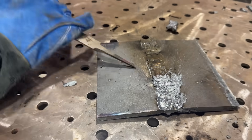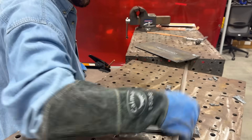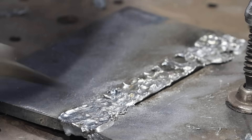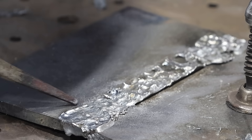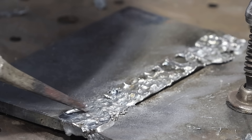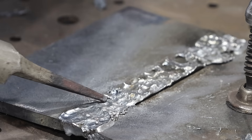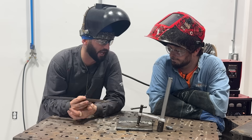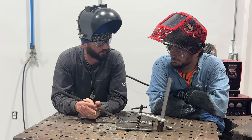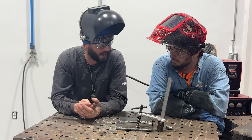You got in there — did I? Yes sir, it's really easy to do. You're doing a really good job of getting all that metal off, but anywhere there's a divot or a low spot — like right here, that big divot — those are the biggest ones I'm seeing. Being right where that bend strap is going to be taken from, you've got to be careful. Arc gouging probably isn't the most efficient, clean, or safest way of removing a backing strap, but from a teaching perspective on how to use the process carefully, I think this is a good test for getting better at arc gouging.